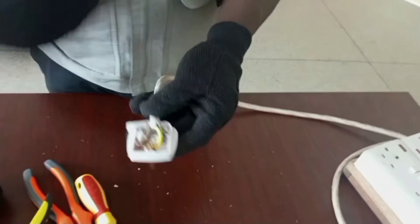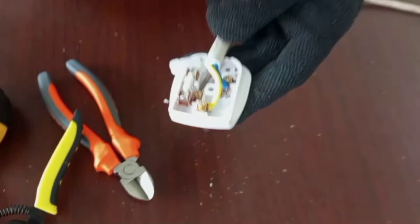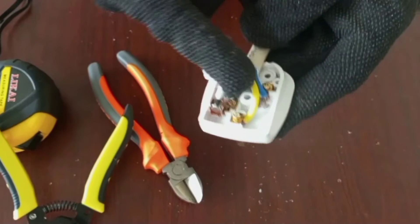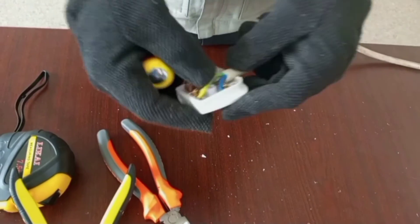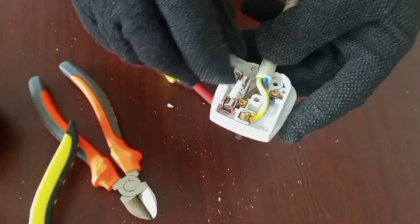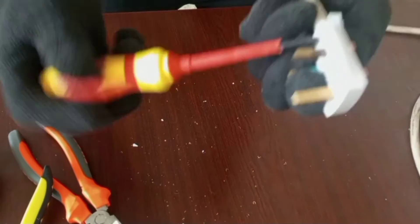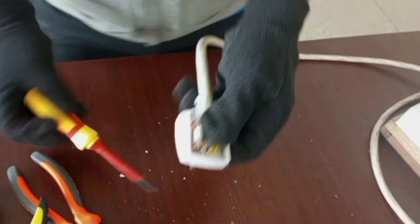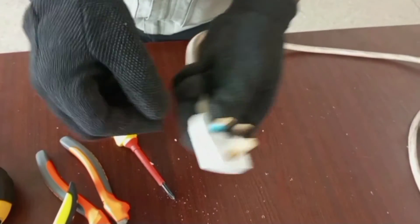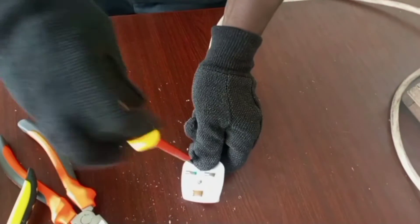After connecting, you'll notice that a part of the sheath — the outer coat on the wires — is still inside the plug so the wires will not be exposed. After that, dress your connected wires nicely. The next thing to do is clamp the cord, so loosen the clamp screw a little, then clamp the cord and bring back the screw, making sure the screw enters the hole on the clamp, then tighten.